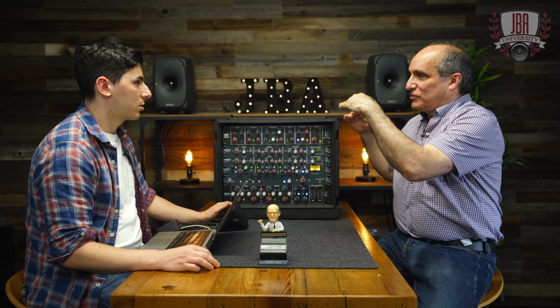You're still able to drive the output tap of that transformer and get all those cool saturation effects, but you're not creaming the level. There's no sonic compromise going out the minus. They are identical sounding. It is just 6 dB lower in level. They both saturate. Obviously, the -6 saturates earlier in terms of level. Yeah. So that way you can get all the love of saturating the output transformer at a lower level. So one's not going to have more output transformer saturation versus the other. The -6 tap will achieve that same level of saturation as the 0, but it's going to happen at a 6 dB lower gain point. So in other words, it is going to happen faster because it's the first thing that would saturate, and then the higher output tap would have 6 dB more headroom. So think of it as headroom before the saturation is happening.